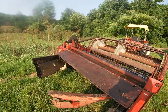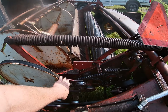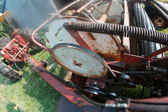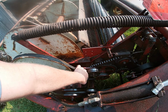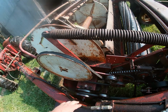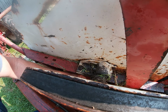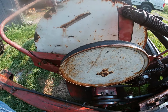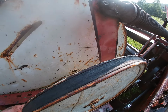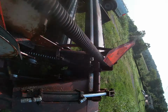So anyway, I didn't video mowing hay because I didn't have my cameras. But when I was cutting the 2 month overripe grass hay down there, my reel belt was slipping. While I have more adjustment here, I have a new belt also. But since there is adjustment, I'll probably just adjust it. I did not know if I had any adjustment left or not, and I already had a belt.